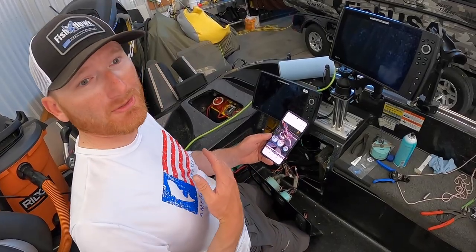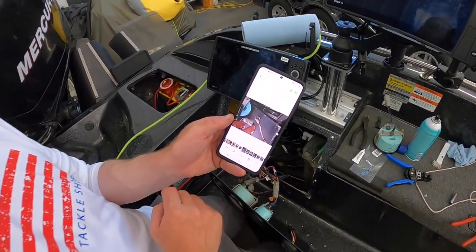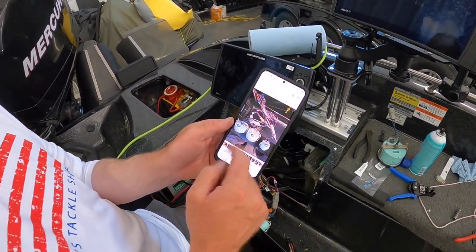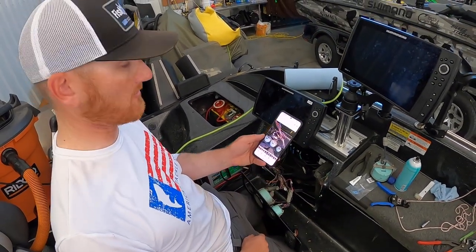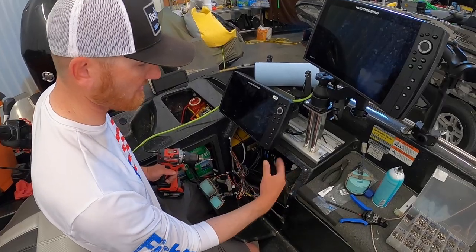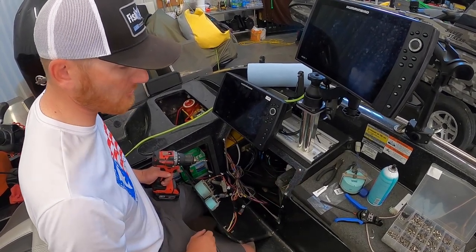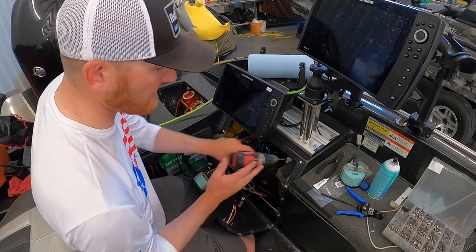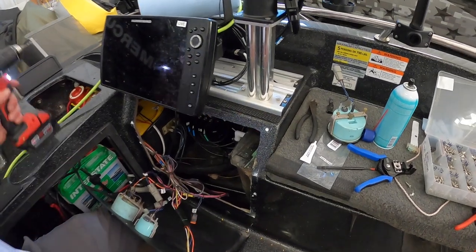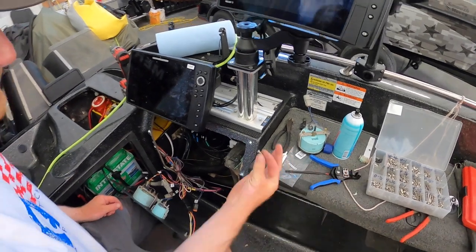Another little trick I like to do when taking anything apart is take some pictures on the phone. That way I can make sure if the labels come off, or in cases where the wires could go either way, I've got a backup plan. I took the drywall plugs out because the screws had become blown out, put some 4200 in there and let that sit for a few days. Then we're going to pre-drill some little holes in that — it's a rubbery compound but it'll take up that gap so we don't have any slop with the small screws we're going to put in.